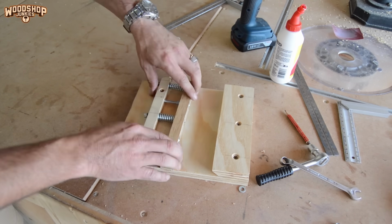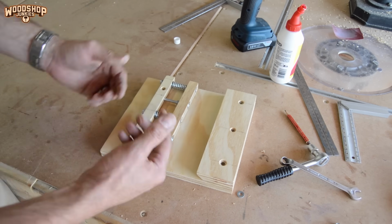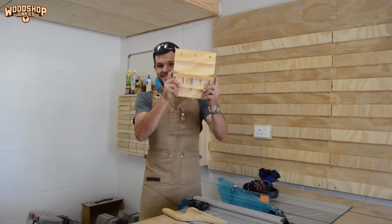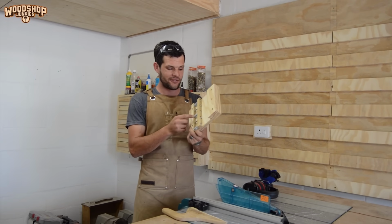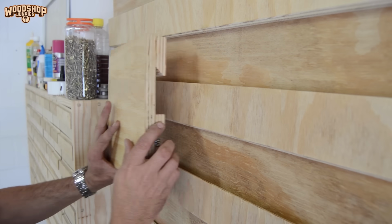And that's pretty much it. Now you can see when the springs are compressed all the way, it is underneath the bottom line, which means that the stroke is long enough to allow engaging the cleat. And that's pretty much it for my self-locking cleat mount, or version one at least. I can tell I'm going to have to mess around with the spring tension a bit and also the stroke length, but for now at least I can test it.